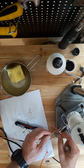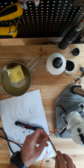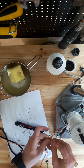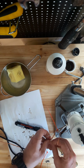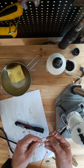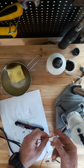So one thing that can be easily done with this Flexweave wire is that you can just make a little hole in it, and just thread through the tail of the loop, I suppose, whatever you want to call it, like this. Okay, and when we solder this, we'll put this wire under some tension just to keep it straight, and also